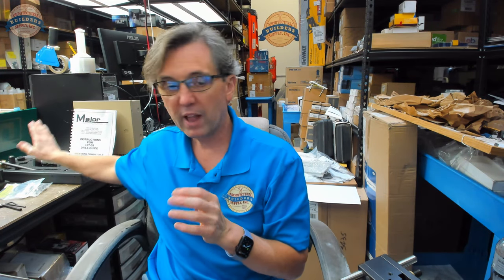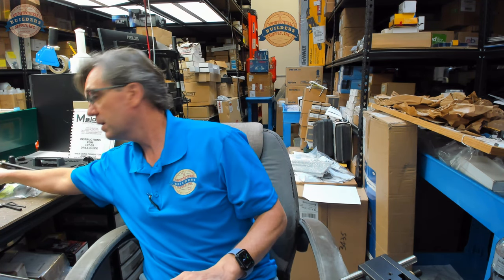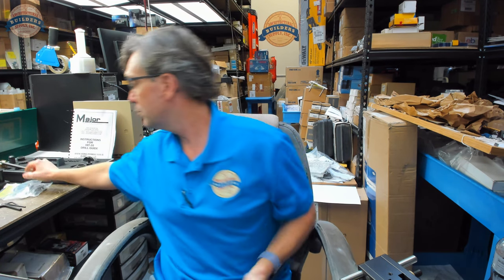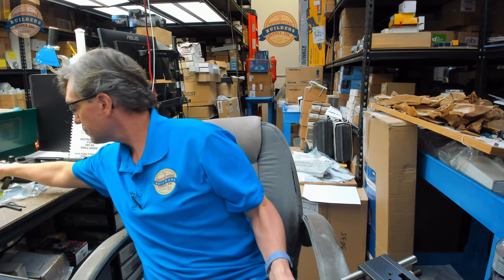So the latch marking tools, I never use these. Now, in a frame, I'm going to use them because it's better than nothing, because I can't get my router template onto an existing jamb. So that's where I would use not a latch marking tool, but the strike marking tool, the two strike marking tools that are included. This, for the frame, is where I use those.